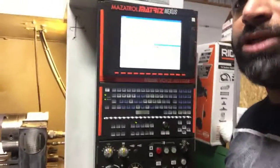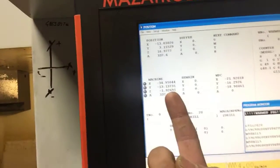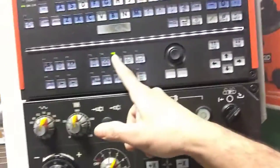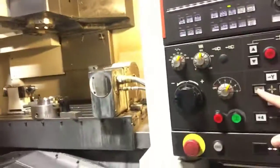The first thing I'm going to do when I start turning on my machine is send all my axes to home. Right now you can see the machine position — none of them is red. So I'm going to press the home button and now I'm going to jog minus and then plus. Look at that — my X axis is going home now.